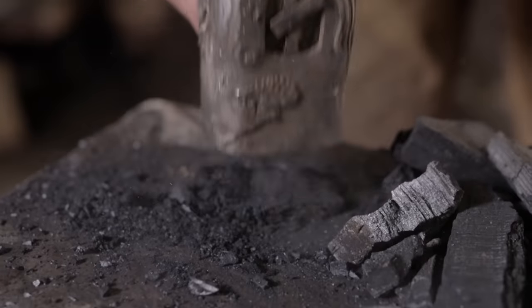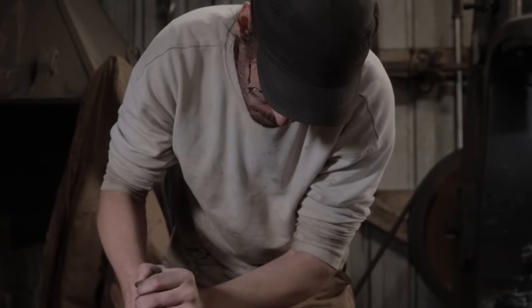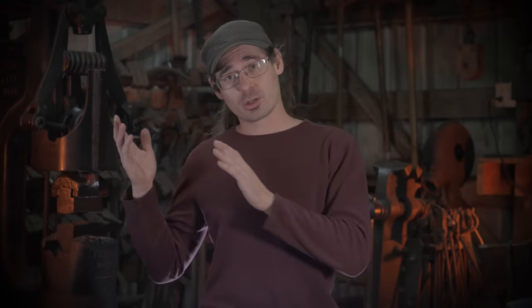This leads me to a very important misconception in blacksmithing generally. The misconception is, if your bar is sparkling, it means it's losing carbon and you have burned it. That is not always the case, to the point that it's misleading. You see, what happens when you're using hard fuels like coal or charcoal is that under high temperatures, burning, the carbon is released in a form of gas and then it interacts with the oxygen in the air. But it is gas first without any additives.